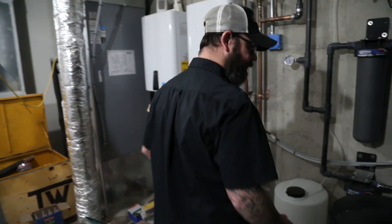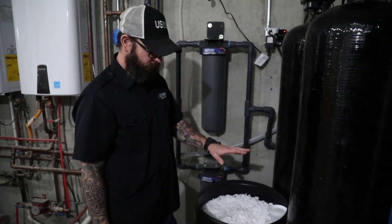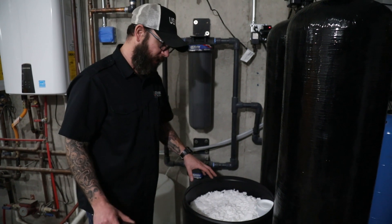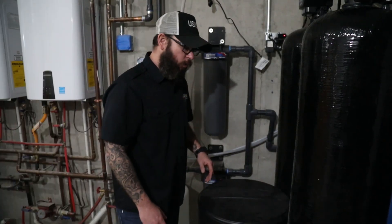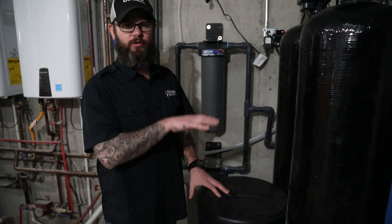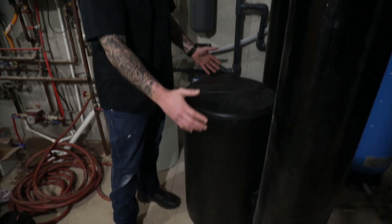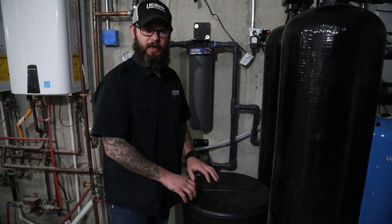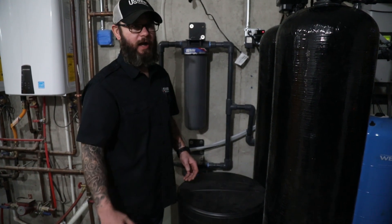We've already filled the salt tank with salt. You won't necessarily see a water level with this much salt — water level will vary based on the size of the unit. Moving forward, when you lift the lid and you can see water over the salt level, it's a pretty good indicator that it's time to add more salt. For a one or two person household with relatively low water usage, don't fill the salt tank completely full. Let the unit cycle through and use all or the majority of the salt before you fill it back up — avoid constantly topping off the salt tank. Fill it, let it cycle through the salt, fill it again, and follow that pattern through the remainder of the unit's life.